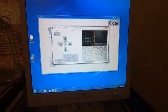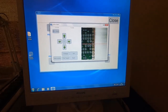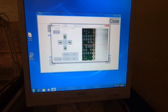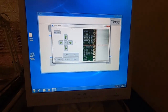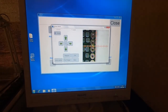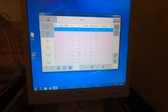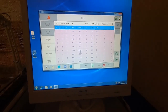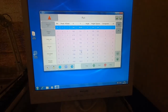Click on set and then do the same thing with the last mark - the board extends a bit further out than it appears to, so make sure we're properly aligned. If you get an error message popping up at this point it means that you've got the calibration marks wrong or they're nowhere near where the machine thinks they should be, so just check everything is as it should be.